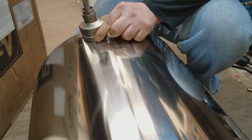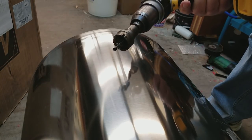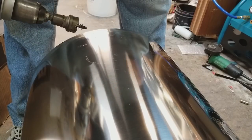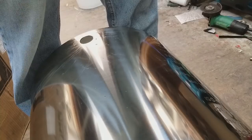I'm making sure there's a half-inch gap between the bottom of the pot and the bottom of this fitting. Hold it there, take a marker, shove it through here, and spin it around a little bit — that gives me a drilling location right there. We're going to use a 32 millimeter tungsten carbide hole saw bit — 32 millimeter is close to inch and a quarter. Tungsten carbide is amazingly good at doing this type of work. I have some high-viscosity cutting fluid on the bit already. Apply solid pressure at moderate speed.